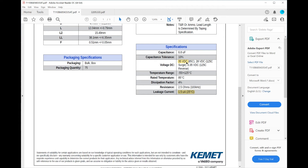So we apply 35 volt DC across it and we should not measure more than 1.5 microamps — it's as simple as that. To measure it, you just apply the voltage and measure the current. You do need a multimeter that can go down into the microamps. For metal film capacitors, polyesters, and similar, you may need to go even lower — if you see a microamp on those, they're probably faulty. Every range of capacitors will have a datasheet like this, and if you can't find one for your specific part, find one for that type.